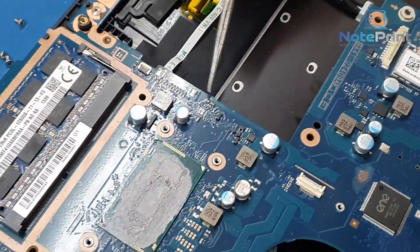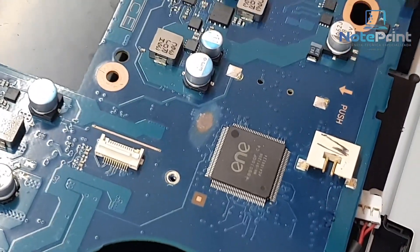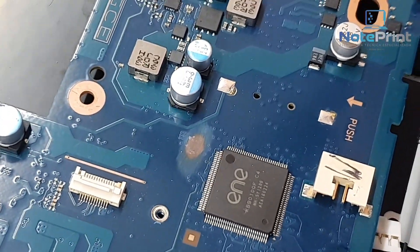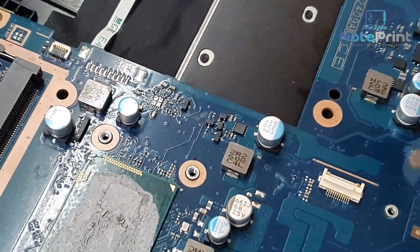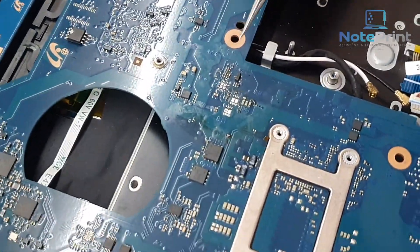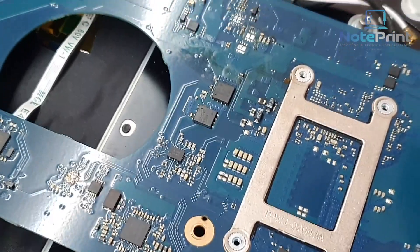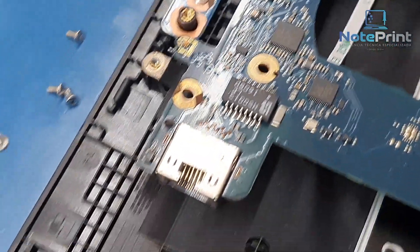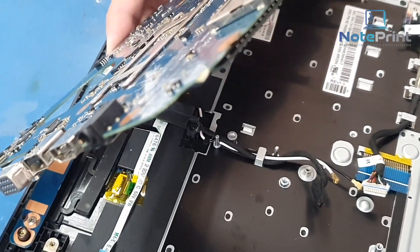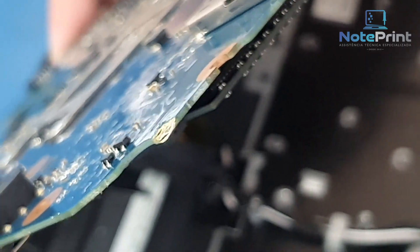What's missing here? There's a missing PWM. Here there's a mark — not sure if it's from sandpaper. Here is the Super IO. And right next to it the PCB is scraped. You can see several points where the PCB has been scraped. And the PWM there is missing — that's on this side. Now on the other side, we also found: two missing MOSFETs, and also a missing PWM. There are plenty of flux marks. Here in the corner it also looks like it was heated — it's a bit dark. Here is the LED, and even the LED was overheated. And the board looks like it fell on the ground — here in the corner, even a chip. You can see the PCB layers exposed.